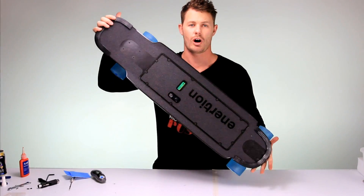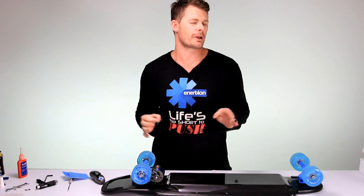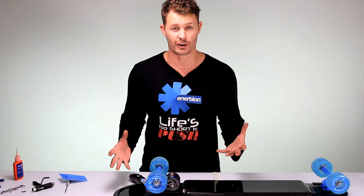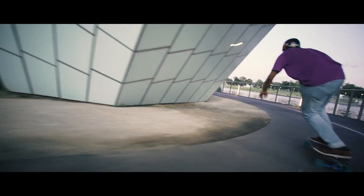There you go — one high-powered electric skateboard built in a matter of minutes. I'd always recommend doing a final check over of everything. Make sure all the fixtures are done up really tightly, the thread lock is where it needs to be, get the belt tensioning right, make sure your wheels are secured nicely, and get the trucks tight enough so they're not too wobbly — because this thing goes 45 kilometers an hour. If you hit that speed and your trucks are loose, you're going to come off. I hope after watching this you can see that building your own high-powered electric skateboard is super easy. You can do it at home with minimal tools and get really professional results in a matter of minutes. If you like this video, please like it, comment, and subscribe. See you later!